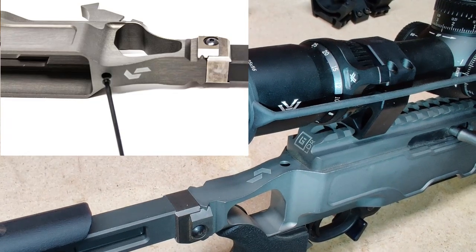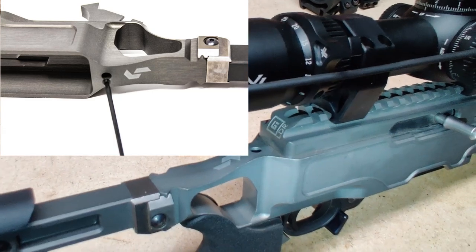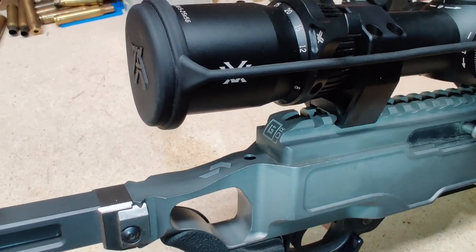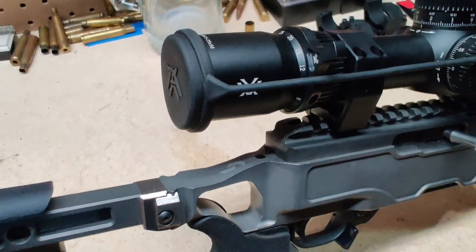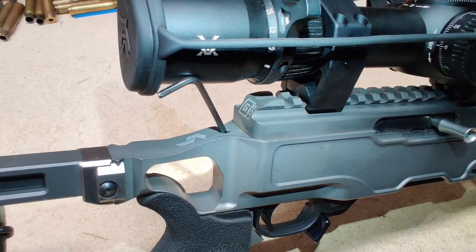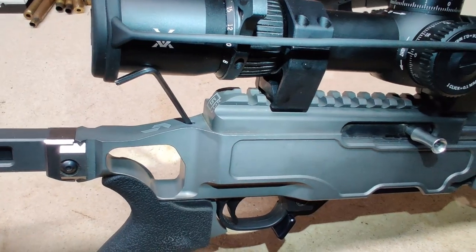The foundation comes with a pair of screws that are designed to be inserted near the back top of the receiver and screwed in to put pressure on the trigger housing in an attempt to counter barrel droop common with the 1022. On its face, I thought this was a fantastic idea. Unfortunately, in practice, it is next to impossible to apply these screws once your scope is mounted to your rifle, making the feature a little bit more difficult to utilize than I would like.